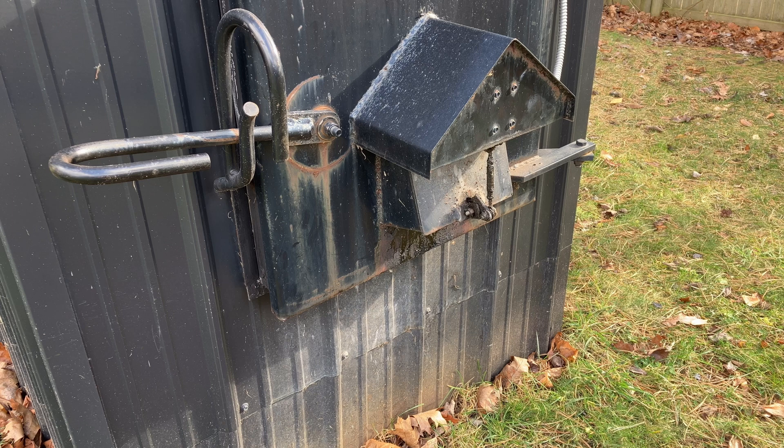There's a damper door on the front of the stove. When the water temperature drops below 160 degrees, the damper door opens. When it gets up above 180 degrees, the damper door closes and it just keeps cycling and circulating.